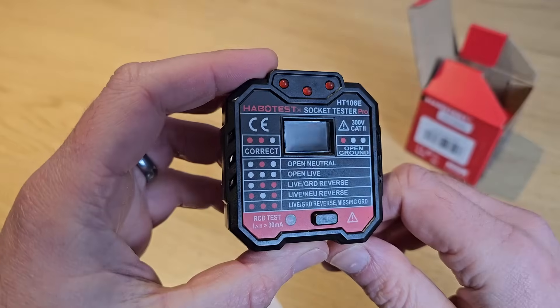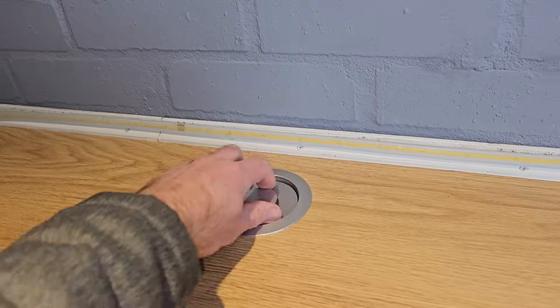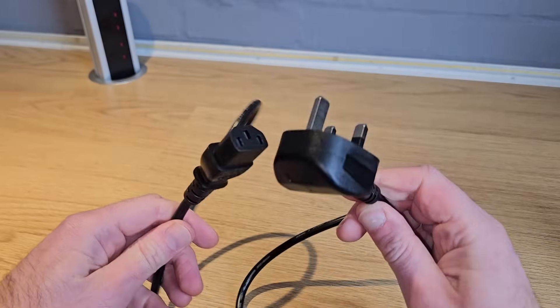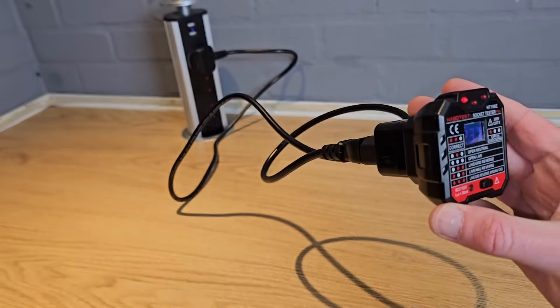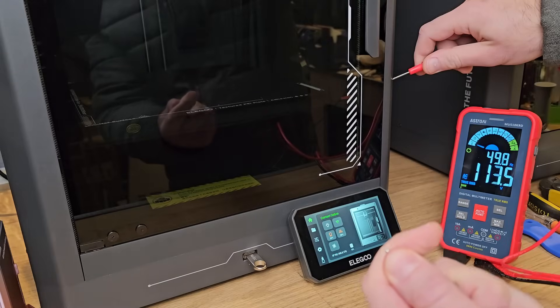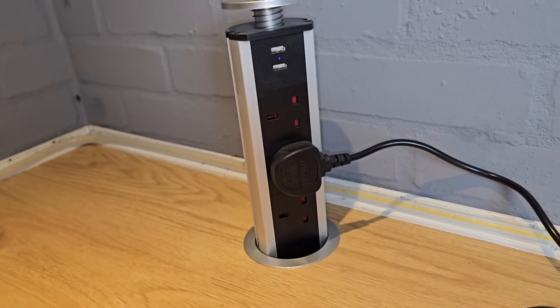I'm not an electrician, so I can't fully explain what was happening, but it appeared that the Centauri Carbon's metal frame wasn't earthed. In the meantime, I'd bought a socket tester to see if there was a problem with my home electrics, which I couldn't find. With the power disconnected, I had a look at the wiring in the printer and to my unqualified eyes found no fault. With Elegoo's R&D team also testing machines and finding no fault, we were all a little confused. To cut a long story short, the problem was a combination of one of the sockets on a retractable extension lead and a power lead that was not supplied with the printer — when I used this combination, it was possible to interrupt the ground connection, meaning the printer was using me as a ground path. When I switched to the actual lead supplied with the Centauri Carbon and used a different socket, there was no issue.